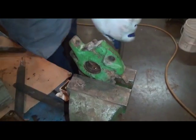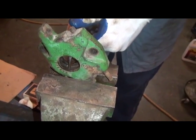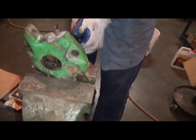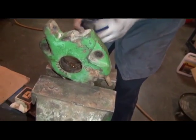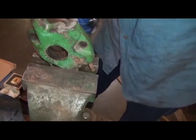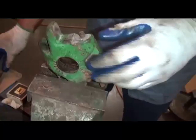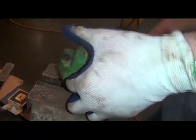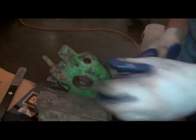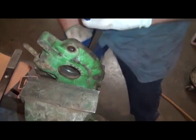Alright, so it's time to put the power shaft into the housing. Definitely while we're here we need to double check. We have this beautiful thrust washer right here on the shaft, and if I didn't point it out earlier, there is a pilot bushing in there that we definitely want to check. That should have been done earlier in the process. If it's worn, scored, or has grooves cut into it, it would need to be replaced. But the only way to remove that is to cut it out or use a sharp chisel and use your imagination. But we're going to go ahead and install this. It is heavy, so it's not a bad idea to get a friend to help.